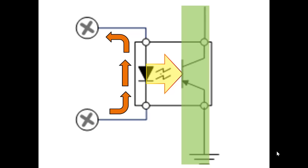Looking at the input device, it's a pressure switch. When the pressure switch reaches a pressure that was set, it has reached the set point. At this point, the contacts in the device change state. The device can have both normally open and normally closed contacts. However, the pressure switch is not wired directly into the PLC's memory.